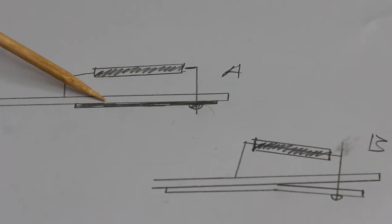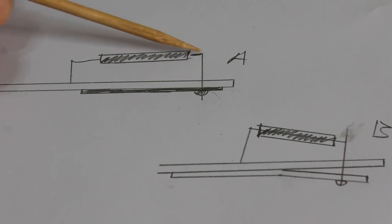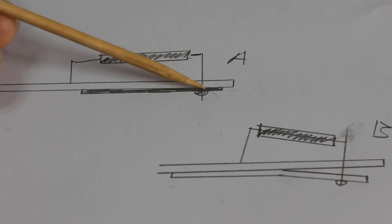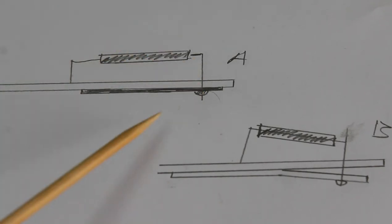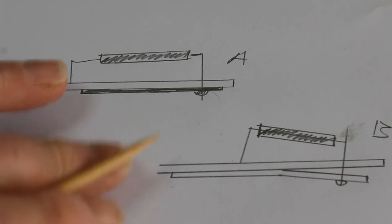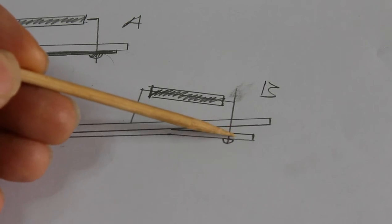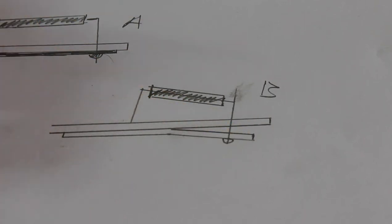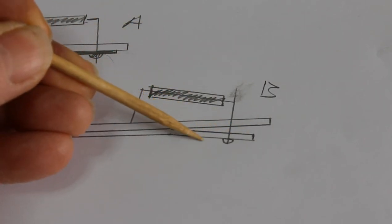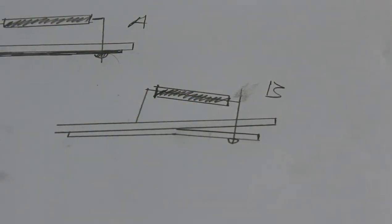This here is the circuit board, and here the darker line represents a trace, and you can see a resistor sitting there. One of the leads has gone through the circuit board, through the trace, and is soldered on the bottom. You can see that little lump there representing the solder. And what's happened in this case is the resistor has dropped, pulling down the trace with it, and it's come unglued. And at a later point, it has literally broken free here, so it's breaking the contact, disconnecting the resistor from the rest of the circuit.